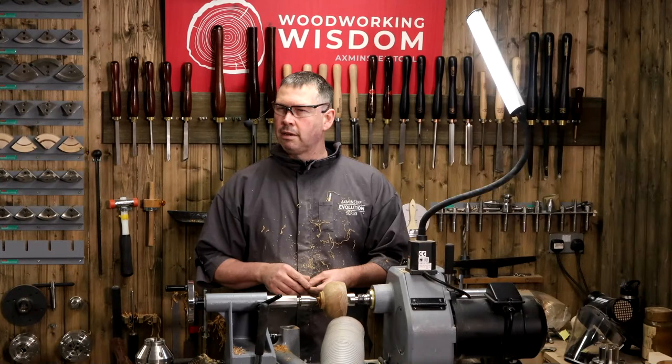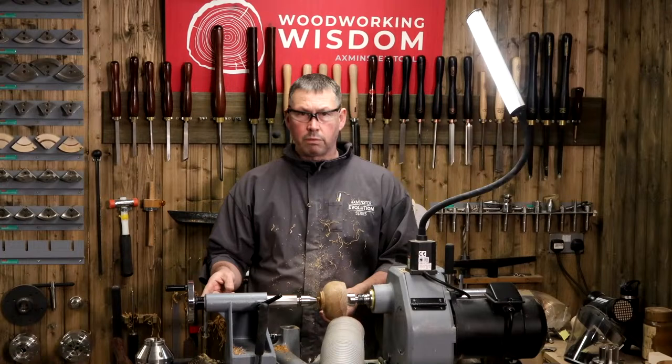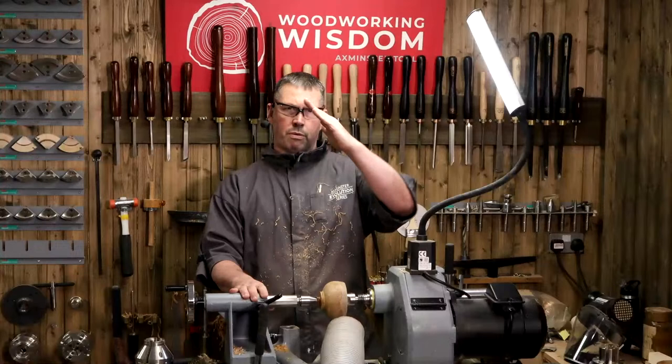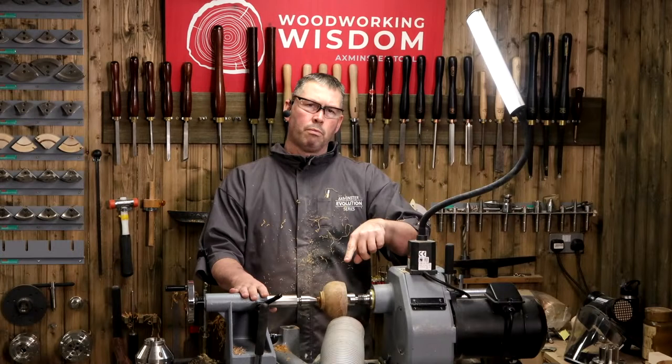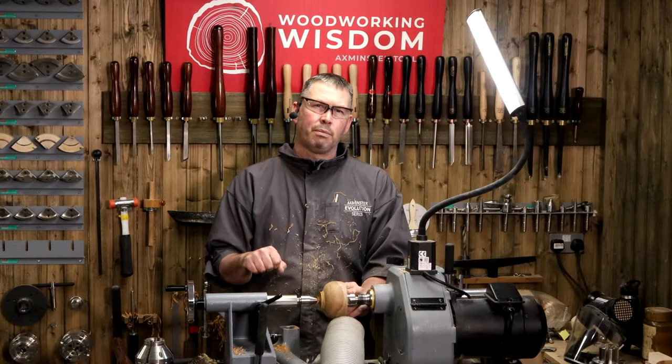And then a question from Jim. He's asking about the bevel angle on your skew. So I'm working with a 55. I'll go a little bit more severe. So even we'll put that angle all the way back up. I'll have a bottom feeder for the center. Bottom feeder for when we turn the bottom, really. Only because if you think about this shape here, we're coming in on itself. So trying to move that handle all the way around, I'll start impacting the rim if I come too far around the handle. So you need that angle less in the bottom.